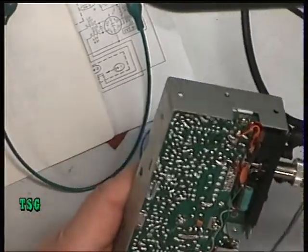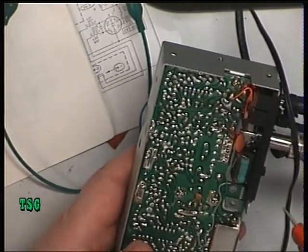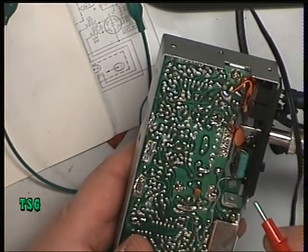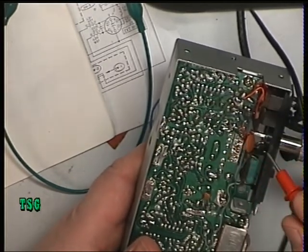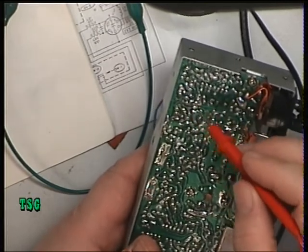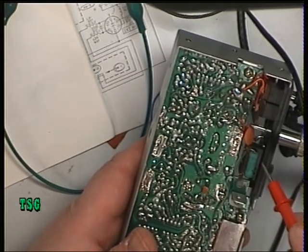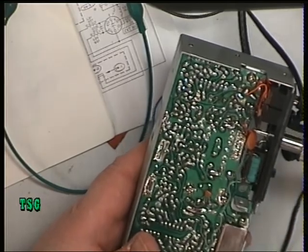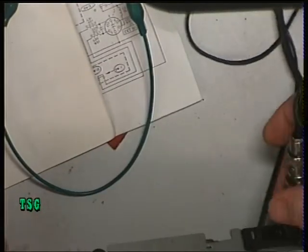I had to take the bottom screen off, which is an absolute pain — that's two lots of screens we've had to take off on this radio. Dry joint. The voltage rail to transistor 2 and transistor 3 was not going through from the regulator. The regulator is IC5 somewhere down there. We had a dry joint just there — that is the voltage feed of resistor 7, which feeds transistor 1 and transistor 2, Q1 and Q2 on the receiver. So it was as deaf as a post.